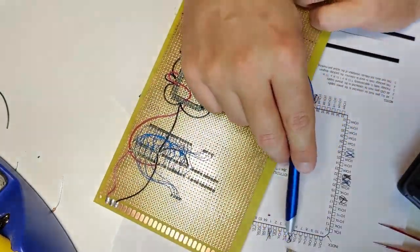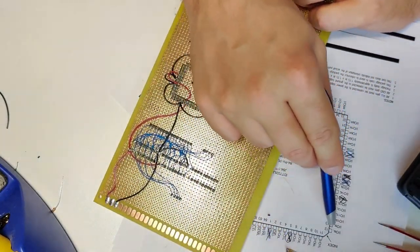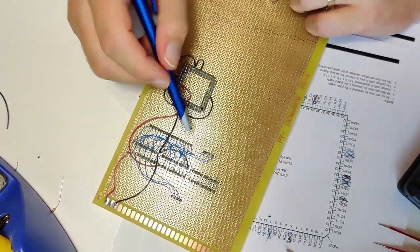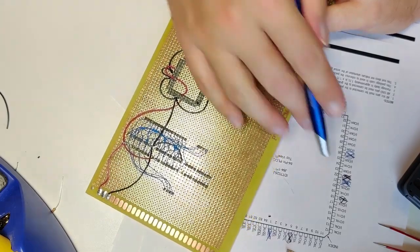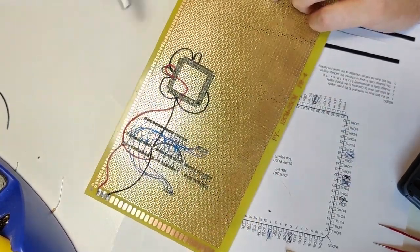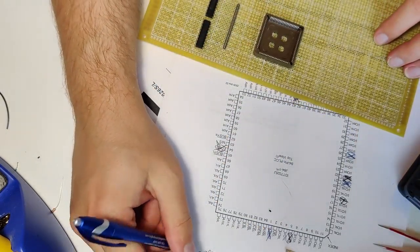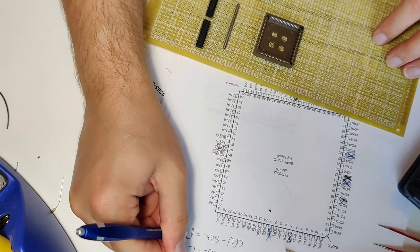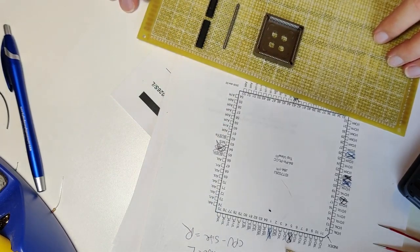I guess that's my next step, is to take the left-hand I/O, which is just going to be output really, and feed them into the mux, because that's going to be my video data coming out of RAM and going into the mux and out through. So my video side is going to be L, and my CPU side is going to be R. Cool.